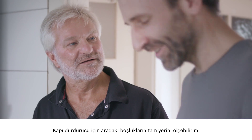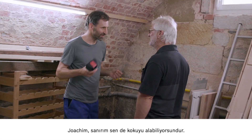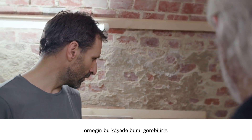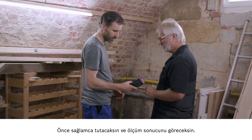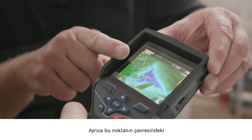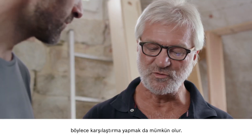For the doorstopper, I can measure exactly where the gaps are so I don't encroach on anything — that's just as easy to do. You might be getting a whiff of something here. Yes, it smells a bit musty. There's a problem with damp in the walls — you can see it in this corner, for example. The most important thing is that you can see the coldest point in the image, clearly a different colour in the temperature display. You can also see the temperature around this point in the wall, which allows you to make a comparison.